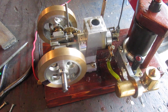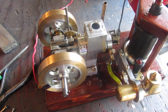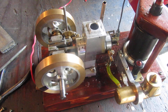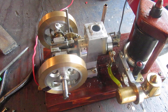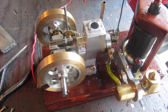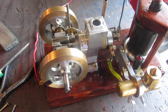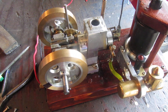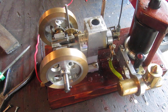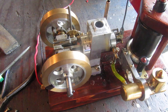I've decided that the optimum on a drag saw is between 12 and 14 strokes every 10 seconds. What that comes out to with the current gear train is about 450 RPM at the motor. So I'm going to have to change my gear reduction by a factor of 2 to 1, which gets me up into the 900 RPM range, which is where this thing likes to run.